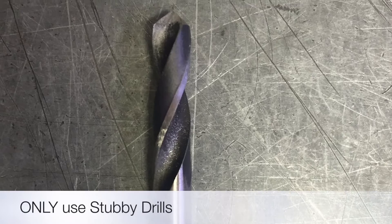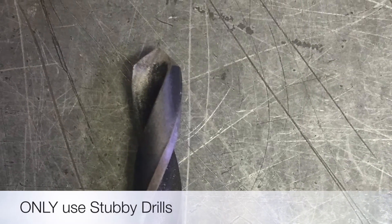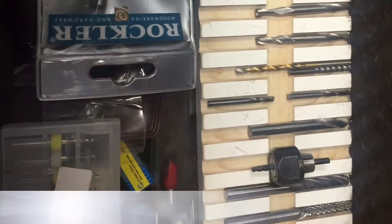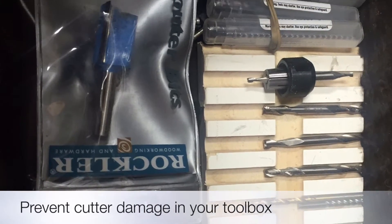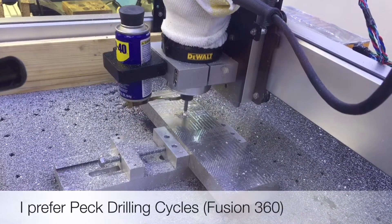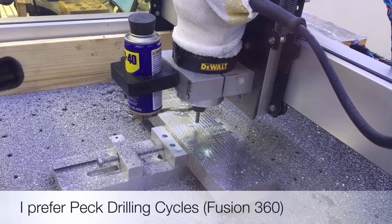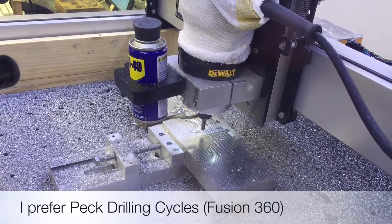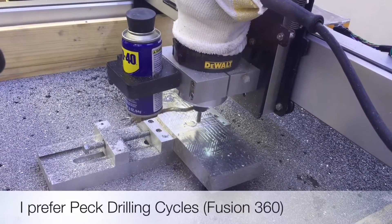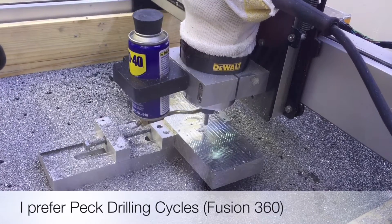I also prefer four-flute. Please, never install a standard-length drill in your router. If it's just slightly off-center, it will bend, break, and be sent out as a projectile. Take care with your cutters. In the video you see that I have uncoated endmills — some of them are old high-speed steel from about 35 years ago when I was a machinist. The uncoated carbide is used for wood and never touches a piece of metal.